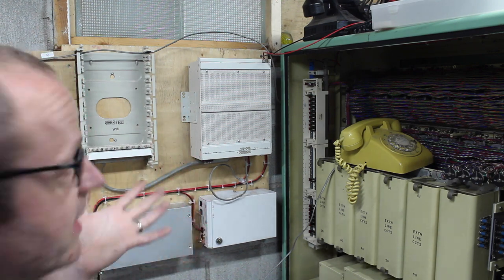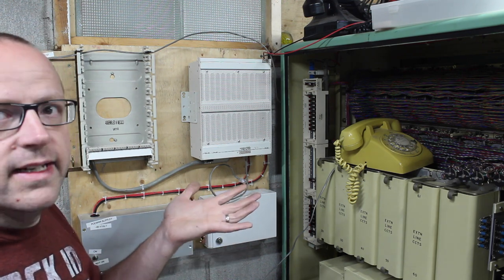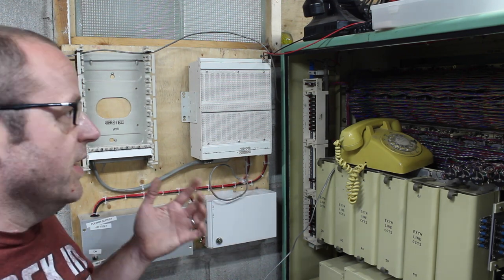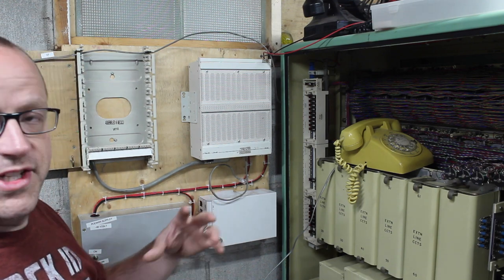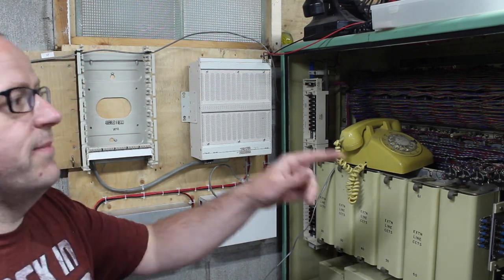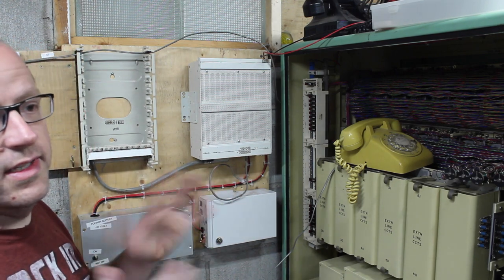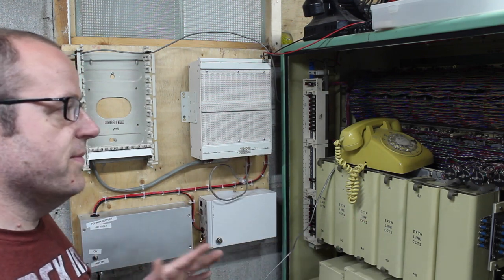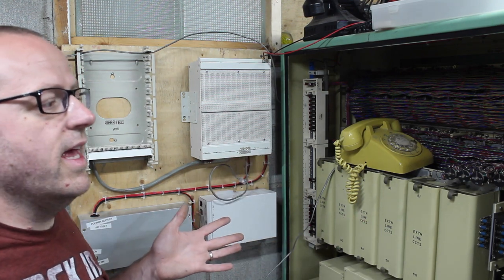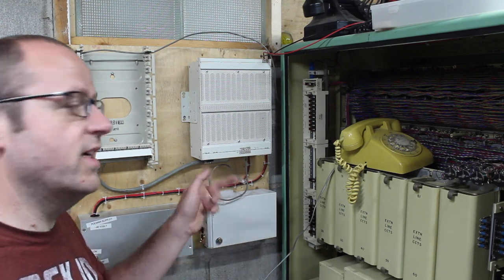But the other thing it'll let me do as well is go the other way around. I've got a landline, if you can call it that anymore, it's on fiber, but I can take that port off of the little Nokia magic fiber box. I take that port and I can feed it back through the same T1, because I can put FXO cards on either end and feed it back this way into this system, so that those extensions in the house can use this system and use the phone line in the house.